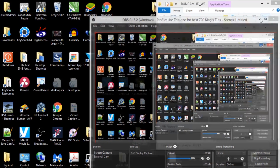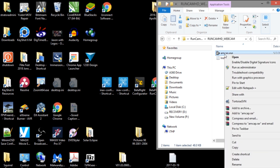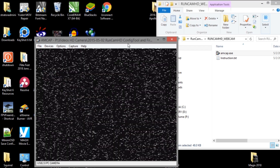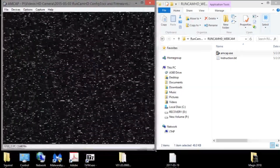Now you're looking at my laptop. I'm going to run a program called AMCAP EXE, just so that we can get a signal from the ROTG. In order to run AMCAP, you have to run it as administrator sometimes in Windows — Windows won't let it do certain things. Now you can see the snow coming from the ROTG, right there, it's just snow.